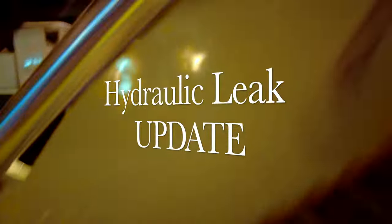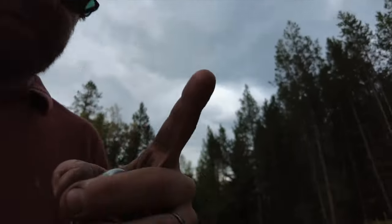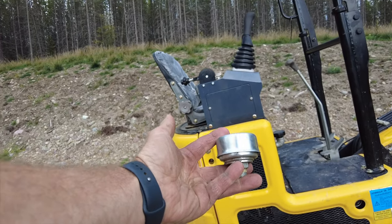This is just a quick China Digger update. A while ago I posted a question about this valve thing that was inside the body leaking. It turns out this thing is just a breather vent, and I finally took it apart. It has an MPT thread, and that thread was just shoved into a hose — there was not actually any barb or anything in there.